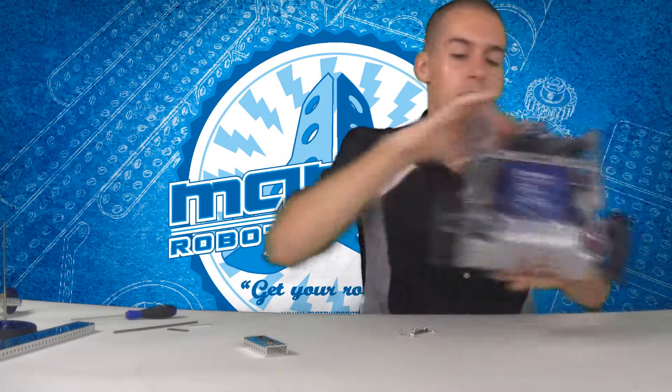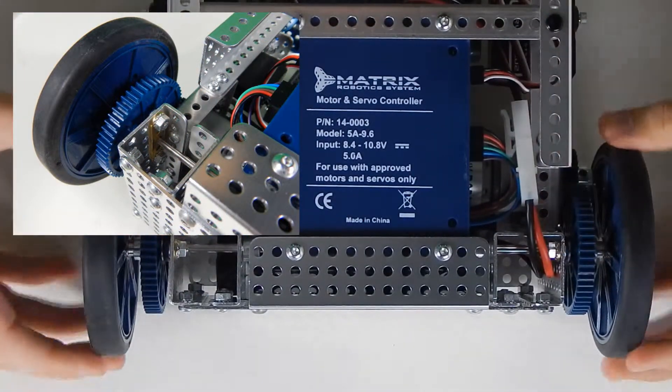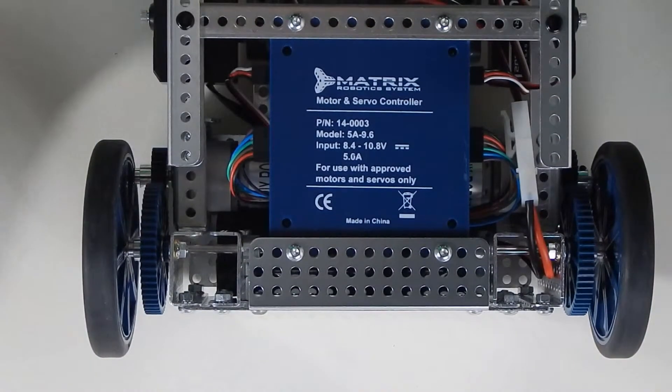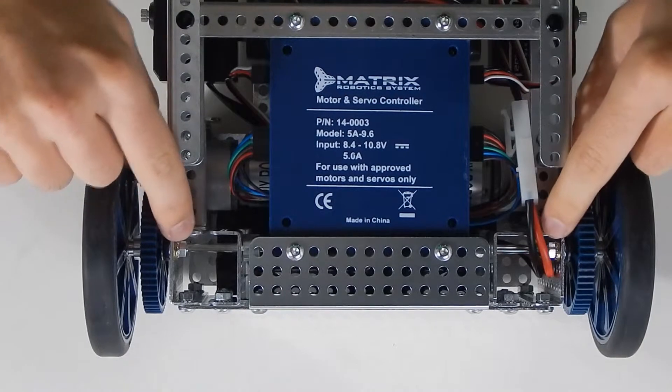Very good for a robot. For example, here's a robot that's using bearing plates on the drive wheels. It's got one here and one there. I would say anytime you have drive wheels you should be using bearing plates. You can see them — they're gold right here.